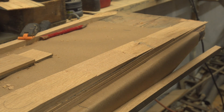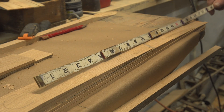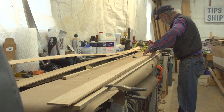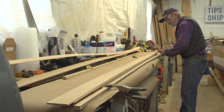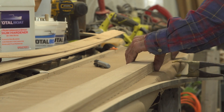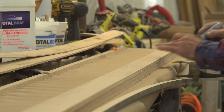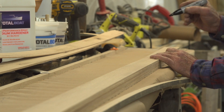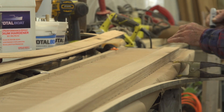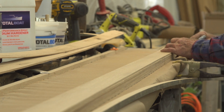It's 19 inches. There are multiple purposes to having this cutwater: you want the boat to be narrower. Right now it's about two inches broader than it should be, and in a sea — especially going towards the weather — that broadness will actually cause spray to come up over the gunnel. We don't want that. We want it nice and narrow, and it's also firm being laminated, so it's a protective piece at the very bow end of the boat.